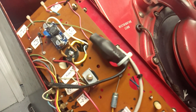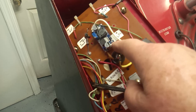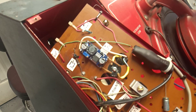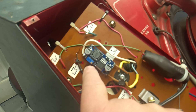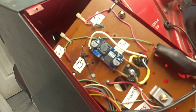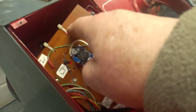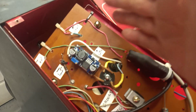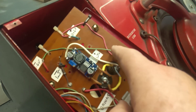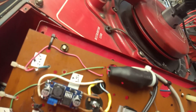This one is modified so it outputs 2.7 volts — that's beyond the capabilities of most of you, so I suggest you just use another LM2596. There's an adjustment pot here; these will do up to 30 volts. If you try to crank it down to the lowest voltage, the pot will be unstable and the voltage will jump all over. What I do is put a 100-ohm resistor across the two outside pins for the 1.5-volt cell, and a 220-ohm resistor for the 2.7-volt cell. These modules have to be floating — they can't share a common power source.